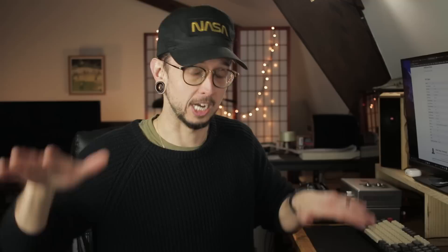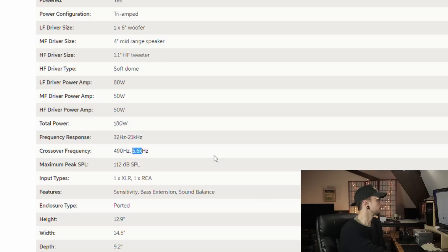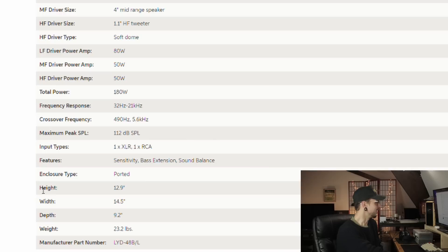This is a good point to talk about powering. I have some good amps I want to use, so I'm not going to put amps inside the speakers — they're going to be externally powered, passive speakers. The Dynaudio has a frequency range of 32 Hz to 21,000 Hz, crossover frequencies of just under 500 Hz and just over 5,000 Hz, a ported design, and dimensions of just over 13 inches high, about 14.5 inches wide, and just over 9 inches deep. We'll start with their dimensions, plug in our actual drivers in software, and make tweaks from there.